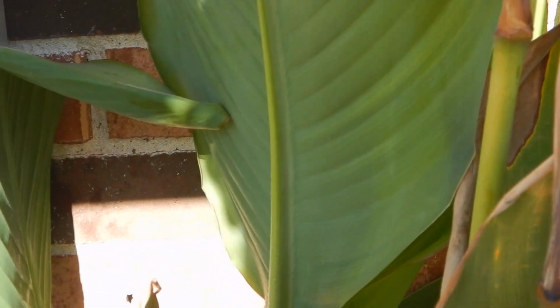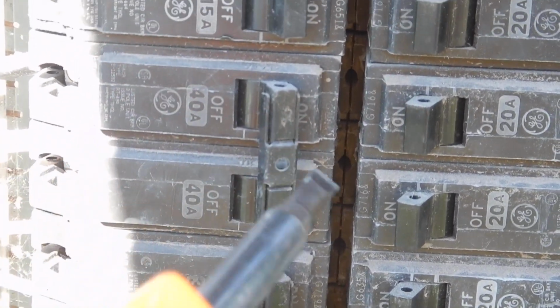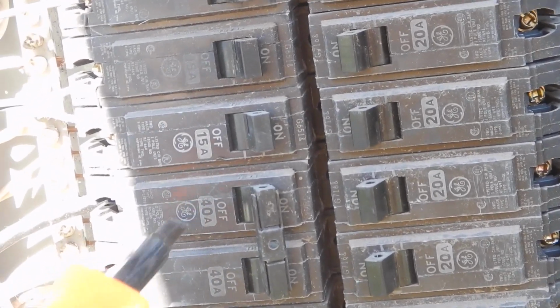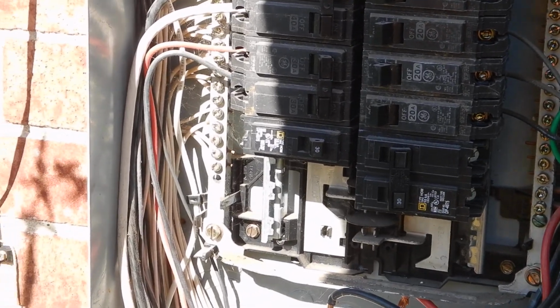So you may get a nuisance trip where the breaker trips accidentally. It was perfectly fine conditions for the condensing unit to be operating, but it tripped on the hottest day of the year. And you don't know. You call an electrician out here, a technician, he comes out, he trips it, and he says, look, it'll probably run like that. It'll get you by for an hour. You're going to get an emergency call, and you get to pay for an emergency call. But if you really want to change that, think about it and save your money, and we'll go there and change it, or whatever they say. It's underfused. L1 and L2 come in. There should be a protective cover around those connections.